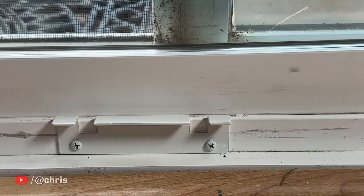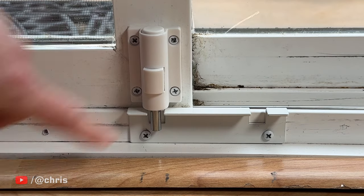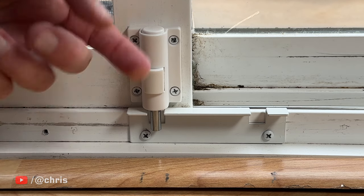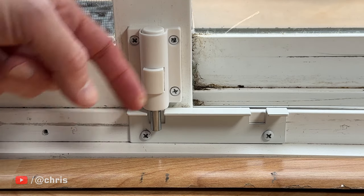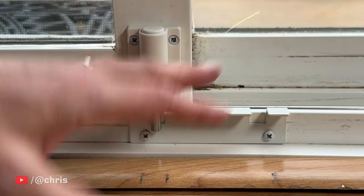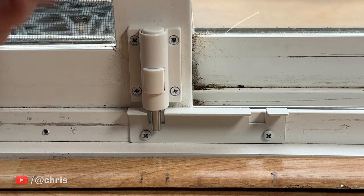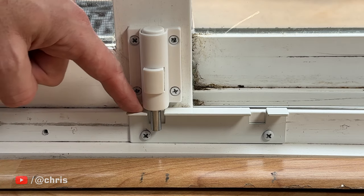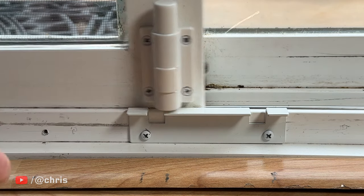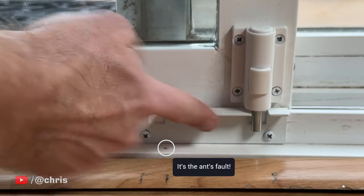This just takes a couple of minutes, but take your time and don't rush. Be sure to use a regular Phillips screwdriver and tighten by hand. So, I screwed up — you can see the hole there, which still worked for the lock position. However, if I wanted to keep it open just a little bit, I can't move the door back that way. So make sure you don't mess up like I just did on this door. This is the second time I've installed one of these and I got it right the first time, but the second time, not so much. Make sure your first notch is in the lock position, because what you want to be able to do is open the door and lock it into that second position. So I had to move the plate. Oops.